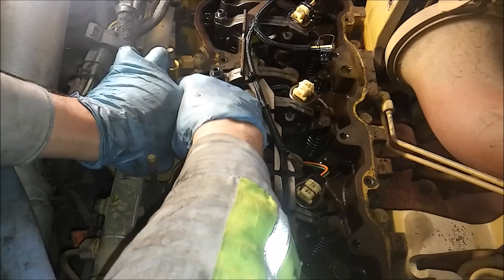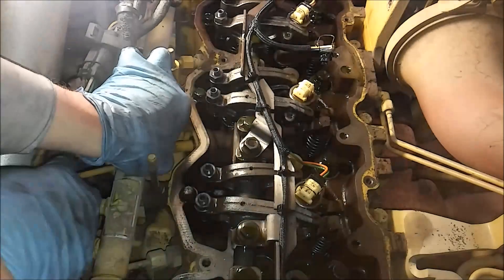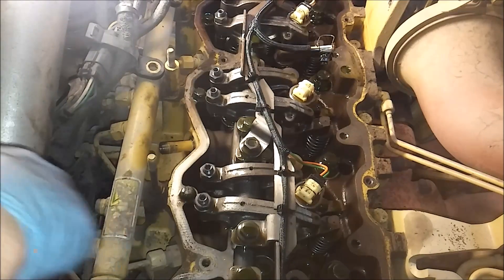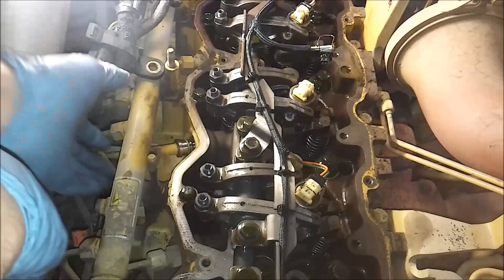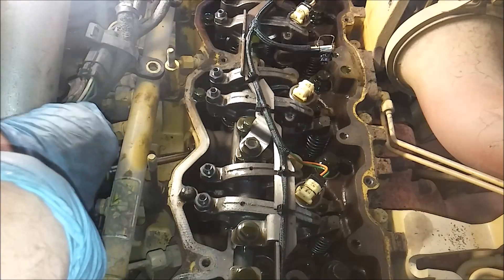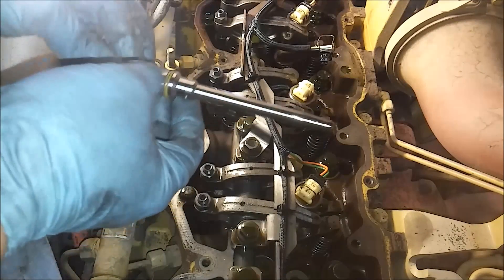I have a couple of jumper lines saved that I've kind of modified on some of these engines to help pull the quill tubes out. I've either turned them or cut them and put little handles on them just for help popping these out. But other than that, you can throw that line away unless you're going to keep it for that purpose. So remove your quill tube - try not to get any dirt or anything from the engine in the quill tube bore.